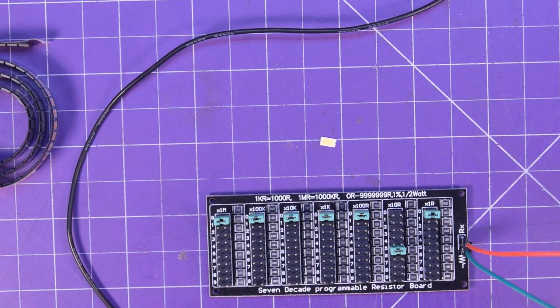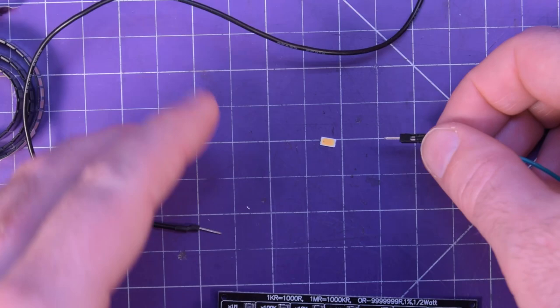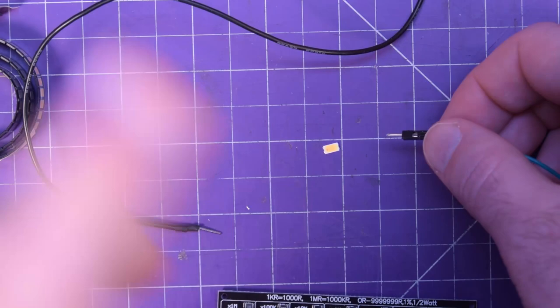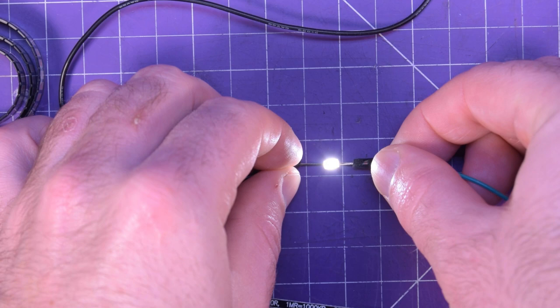Let me see if I can put a 50 ohm resistor and we'll see how bright they're going to be. Got my decade resistor box here set to 50 ohms, in the times-10 fifth slot. I've bumped up the voltage to four volts because my plan is to run three of these in series — that's what they do on those little CRI strips, but they only limit them to, I think, 39 ohms. So I'm going a little bit more resistive than that.